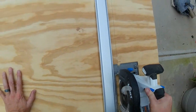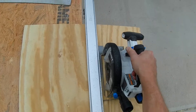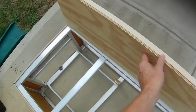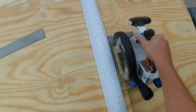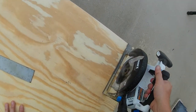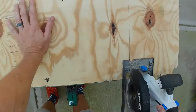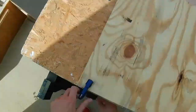The first thing we're going to do is cut the backs to the benches. Let's make sure it fits correctly — that looks pretty good. Now we're going to cut the bottom piece, but watch closely here at the very end. This is a wide four-foot sheet of plywood, and I get to the end and clip it off — I got pissed off and shook my head because I knew I'd made a mistake. My advice is to get something to support the sheet of plywood. This is only quarter-inch plywood.